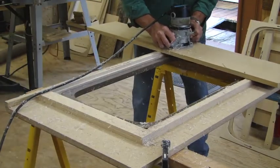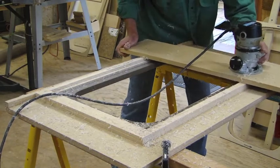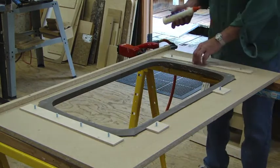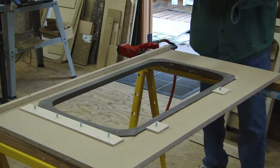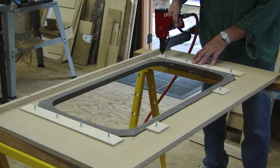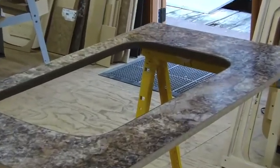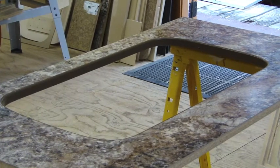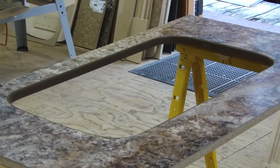With the final machining pass, the integrated location of the sink and countertop is set completely and precisely. The last step is gluing and stapling the locating blocks with their machine screws for positioning and holding the sink. This will be faster and stronger than anything else on the market. Here is the countertop ready to install with an encapsulated edge and fixed mounting points to locate and retain the sink. The lapsed time was about 30 minutes.